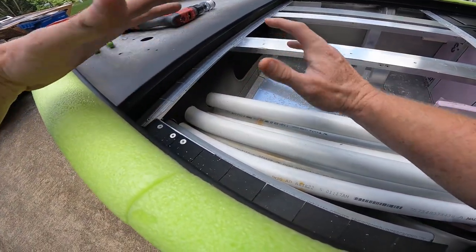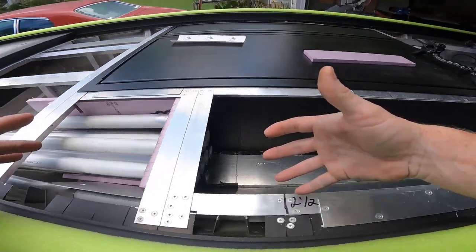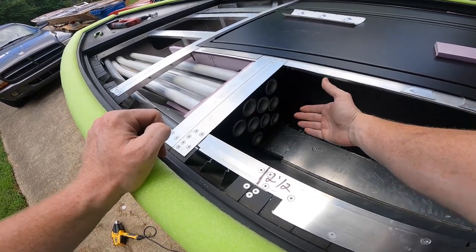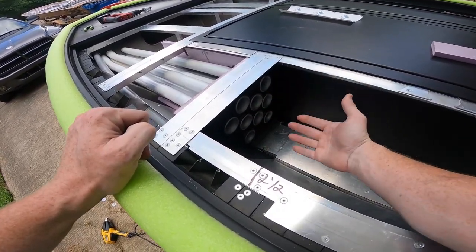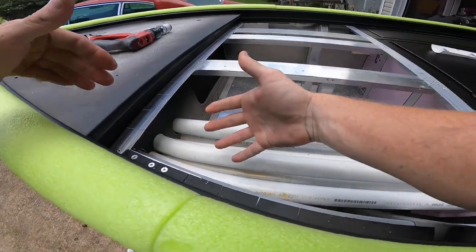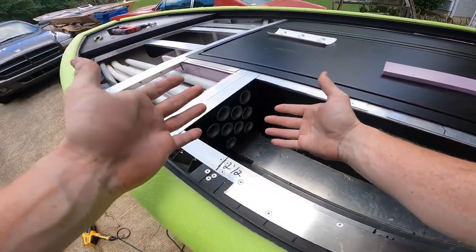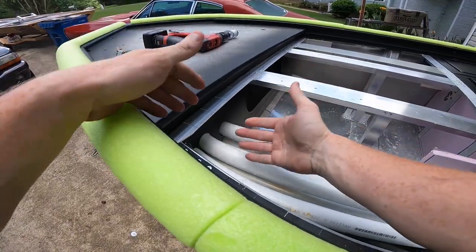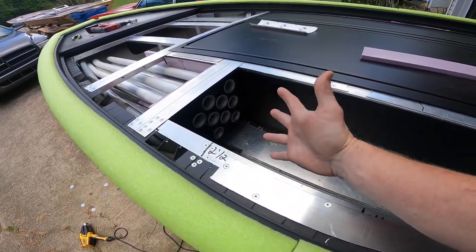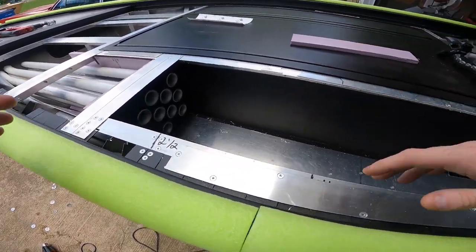So this is gonna look like a gaggle up in here, but you're putting all these tubes into such a small area when you have all of this room up here. If I had done this the other way and put all 15 tubes in here, like I originally could have squeezed in on this faceplate, you can imagine the issues we'd be having down in this area. So that's something to think about. Just because you can get as many rods as possible up here doesn't mean that you're gonna get as many rods as possible back here. That's why we opted to bump that down. We're only putting 9 in here, which is actually 1 or 2 more than I estimated us being able to put in here. So in my book, that's a win.